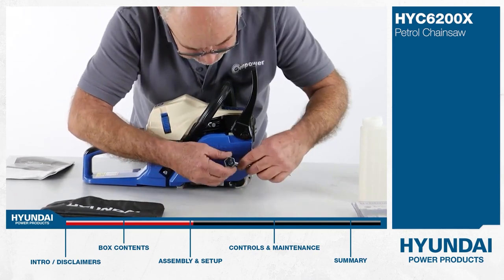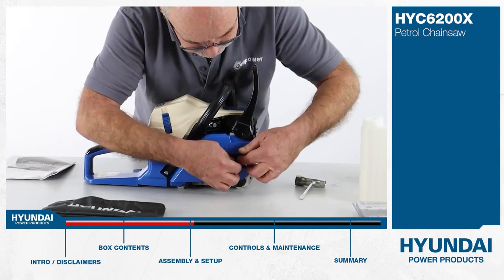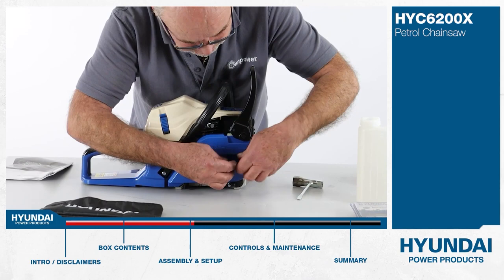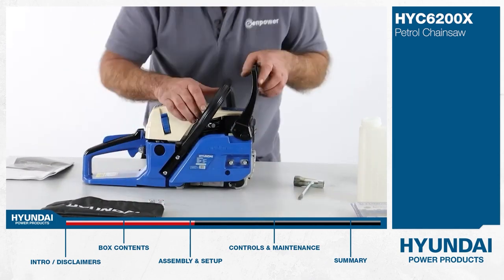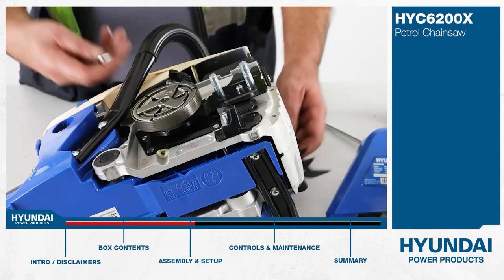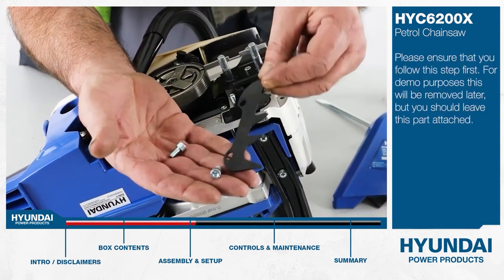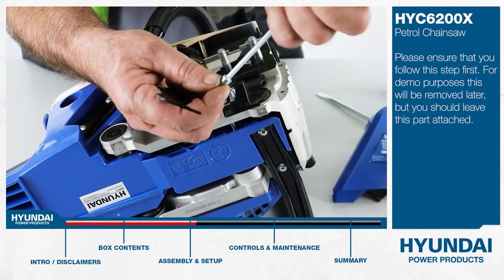So you'll see the 2 bolts here. I'll just loosen them off and remove the 2 nuts, and I'll put those to one side safely. Okay. Then it'll just pull out and away from the unit. So now that we've removed the chain brake, if we go to our toolkit, we'll find this bump spike and 2 Allen bolts and the appropriate Allen key that fits the bolts.